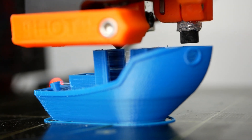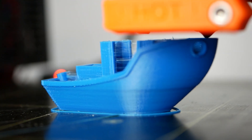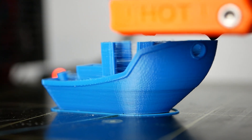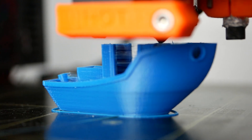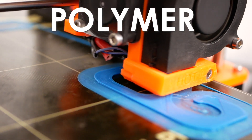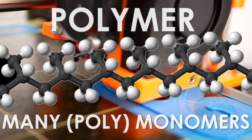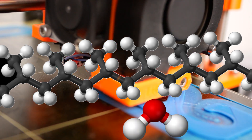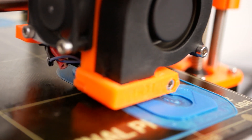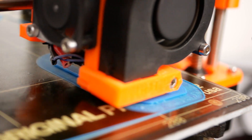The main phenomena that occur with moist filament during printing are foaming and hydrolysis. If a material is wet, the stored moisture basically bubbles up and leaves you with inconsistent extrusion and voids in your material. Polymers consist of many smaller linked molecules — the monomers — that give them their properties. If moist material becomes molten in your hotend, hydrolysis occurs, meaning the long polymer chains get cracked by the water, changing the mechanical properties and causing prints to become brittle.